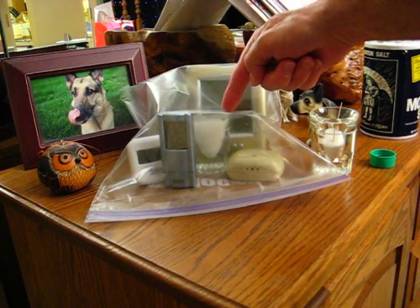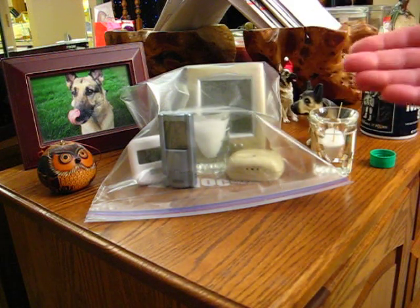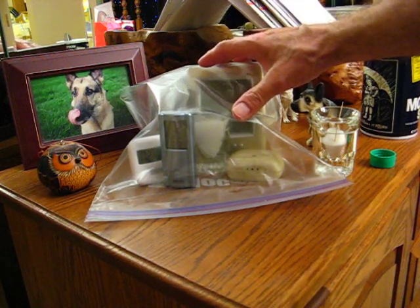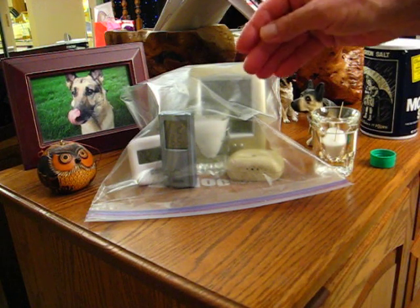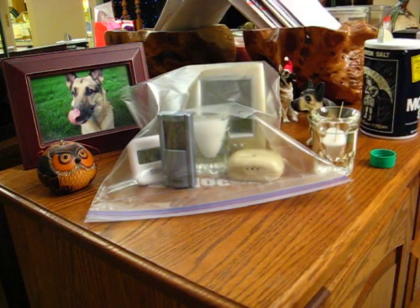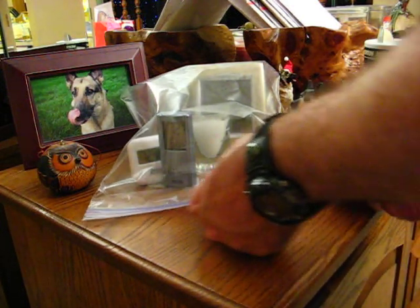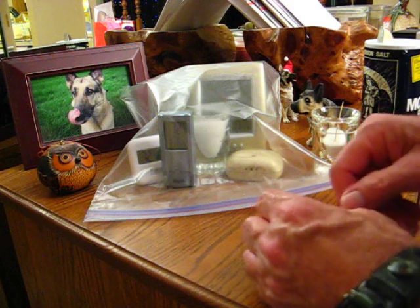You put the wet slurry shot glass — which is right in here right now — with your hygrometer. Table salt has the quality that between about 60 and 80 degrees in a closed environment, a wet salt solution will stabilize at 75% relative humidity. Leave it in a double-sealed ziplock bag for about eight hours — this has been in there about 11 hours.